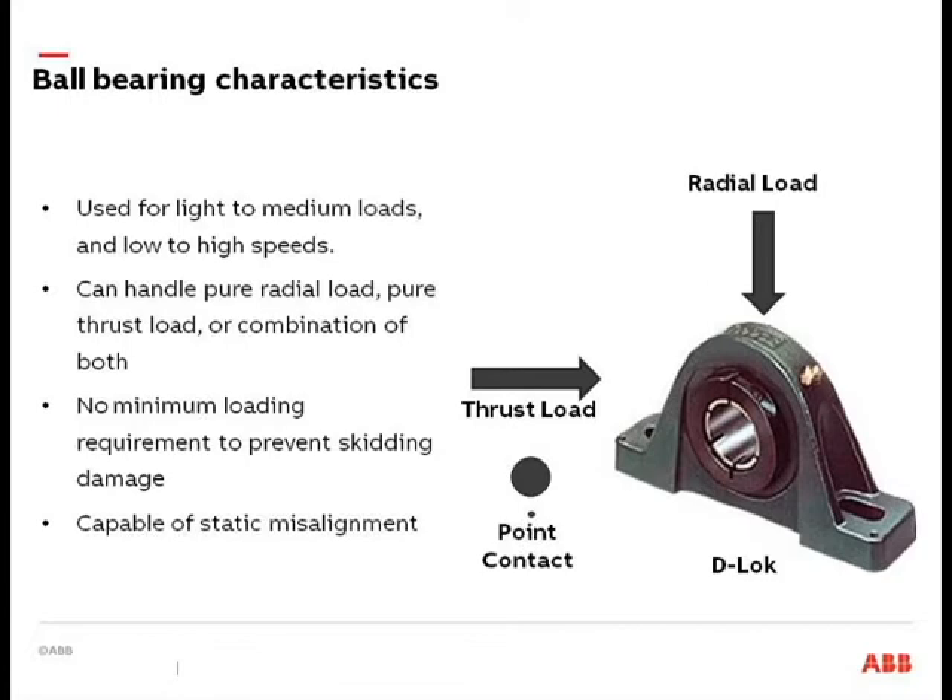What's the difference between radial and thrust loads? A radial load is a load applied perpendicular to the shaft — a perfect example would be a belt conveyor, bucket elevator, or chain/drag style conveyor, because the load is constantly being pulled down on the bearings. A thrust load is something where the load is trying to drive through the bearing bore — an auger or screw conveyor is a good example of that.